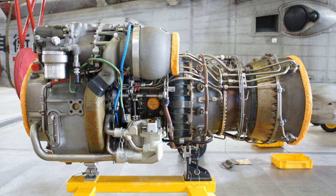Compared with the H-60's primary T700 engine, the T706 has a larger compressor, hot section improvements, and full-authority digital engine control. The T706 is rated at 2,600 SHP and increases the hot and high mission capability of the U.S. Army's MH-60M Black Hawk for special operations applications.